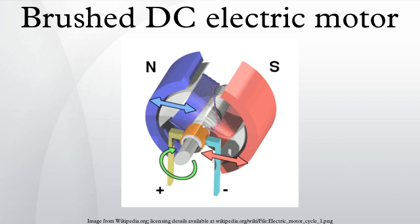In a low-current battery-powered demonstration, this short-circuiting is generally not considered harmful. However, if a two-pole motor were designed to do actual work with several hundred watts of power output, this shorting could result in severe commutator overheating, brush damage, and potential welding of the brushes to the commutator if they were metallic. Carbon brushes, which are often used, would not weld. In any case, a short like this is very wasteful, drains batteries rapidly and, at a minimum, requires power supply components to be designed to much higher standards than would be needed just to run the motor without the shorting.